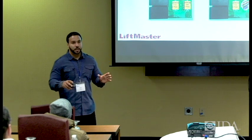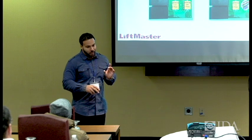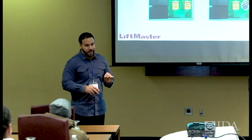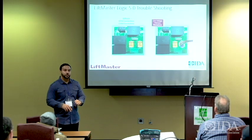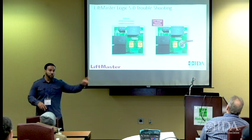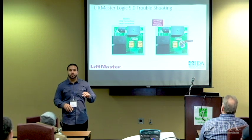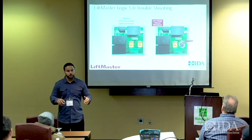I tell people all the time, single phase, it is what it is, but to me, if you got a choice in the matter and you can dictate what's going to be in the field, always go with three-phase. If you can tell the contractor, we want you to get three-phase, and he says yes, then you should be happy. Three-phase is more robust. It's balanced load.